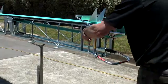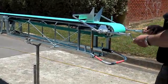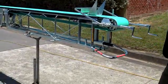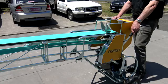Adjustment and alignment of the belt is done by winding the handles at the top of the unit. The correct tension is determined by the load to be lifted. If the belt slips around the base pulley, tighten the belt. If it runs to one side, adjust by turning one or other of the adjustment handles.